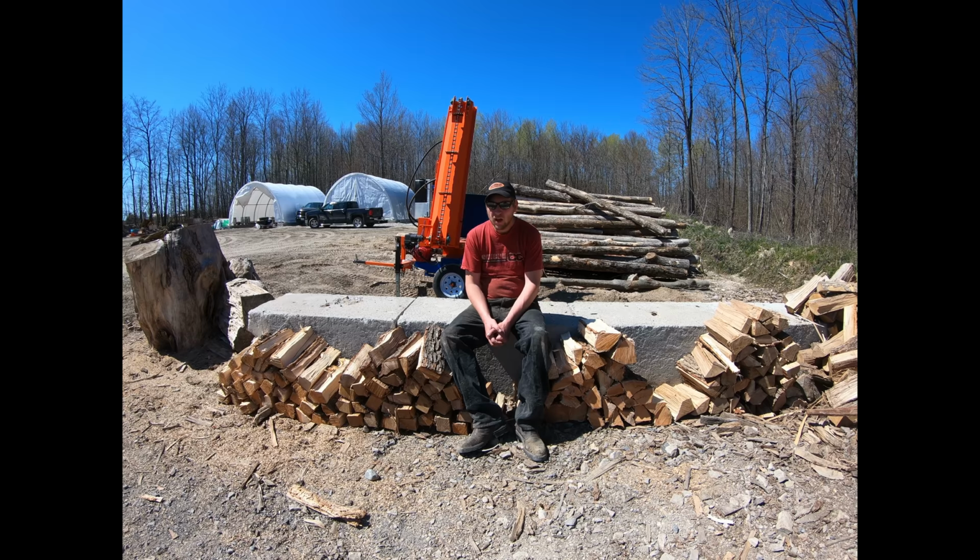Like I said, we have both wedges available on this 2228. I'm not biased to these one way or the other at all. I'd rather make sure that you have a machine that's going to produce and be efficient for you. I'm far more concerned about that than which wedge you pick. But as you can see, if you have one of those grid style splitters, they're not going to make as nice a wood as this. You're going to have a lot more slivers and a lot more binding going on. That's my experience with them, so take it with a grain of salt, if you will. I've tried them a lot of different ways and built a lot of different wedges, and in my experience they just don't work as good as that particular 12-way wedge does.